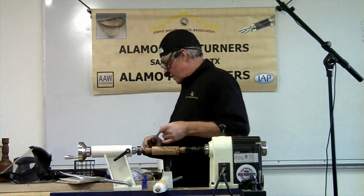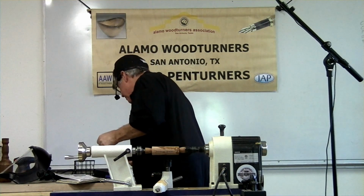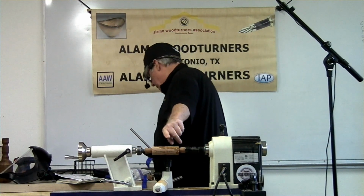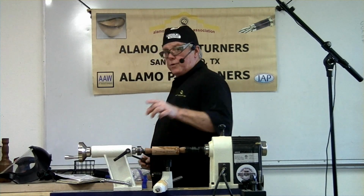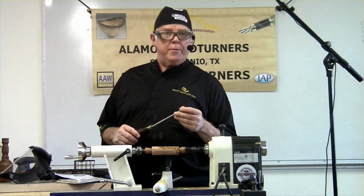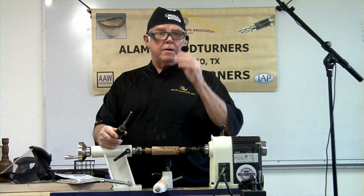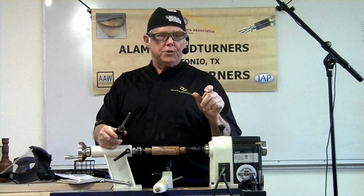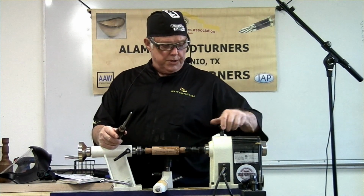They're sized, if you look at the plans, 1 inch in diameter by 3/4 this way by 3/8. The ones that are there are the ones the factory made. We were waiting for the kits to get here, so I went online and got a copy of the plans. It showed the bushings, so what the heck, I made my own bushings just to practice with.